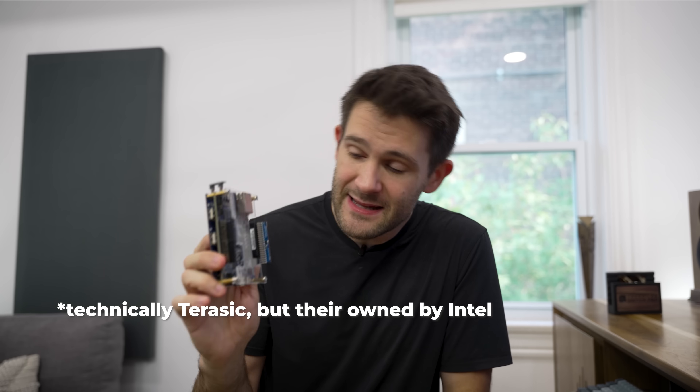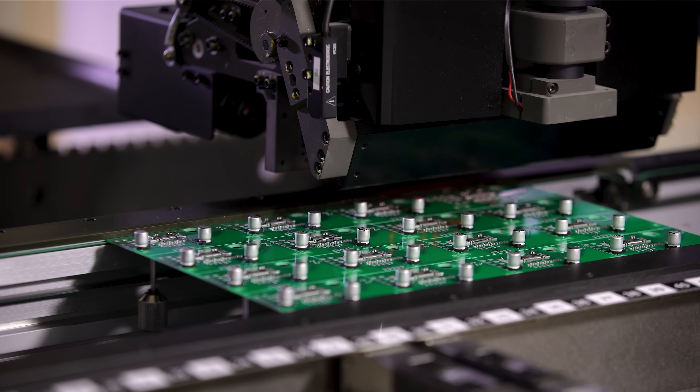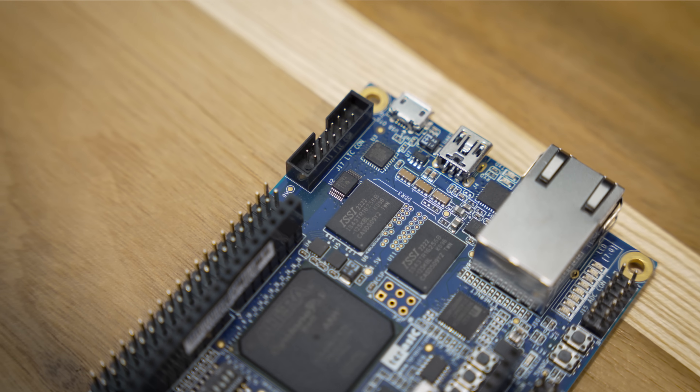So what's the solution? Is it just to have a closet filled with tons of old retro game consoles and hundreds of cartridges? I think there is a much better solution for most people. I'm talking about hardware emulation. This right here is a DE10 Nano — a really interesting little tool made by Intel. At the heart of this mini computer is an FPGA, or Field Programmable Gate Array, which is just a fancy way of saying a chip that can reprogram itself. Most computer chips are rigid in their operation, designed to function in a handful of predetermined ways, making them small, power efficient, and cheap. An FPGA trades all of that in the name of flexibility — it can reconfigure itself on the fly to functionally become other hardware. So today we are going to create a purpose-built emulation machine that should be functionally identical to the real thing. It's like emulation on steroids, and I am so excited to try it out.